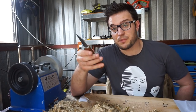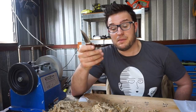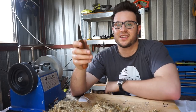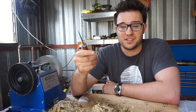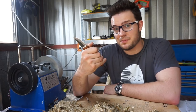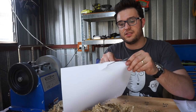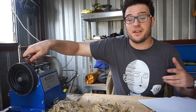So that was 225 with my slightly steeper edge. This is the kind of steel where if I went to 17 degrees and mirrored it, it'd cut like a beast — you'd get to like 400 or 450. But it's not my knife and I'm trying to operate under the intended purpose. If I put a 17-degree edge on steel this hard, 64-66, you're probably going to have significant rolling and chipping when the owner tries to do his woodcrafting. As it is now, 225 is as far as I'm happy to push it. Right now it's definitely skipping along the surface of the paper making tear cuts. We're going to see what stropping does to get that edge back.